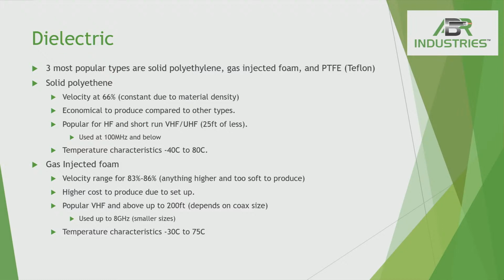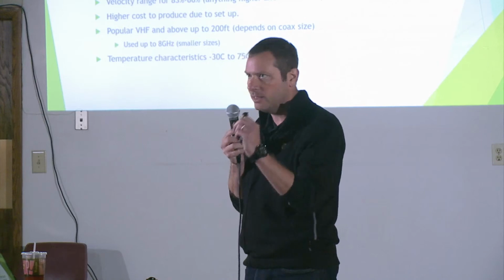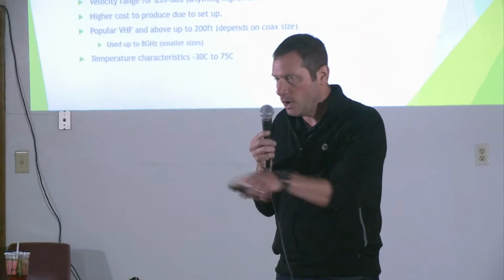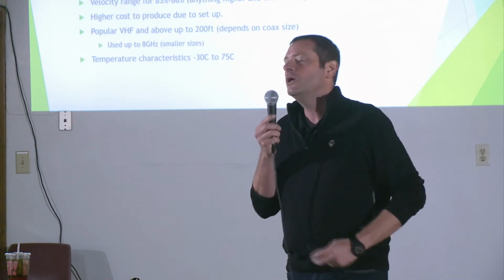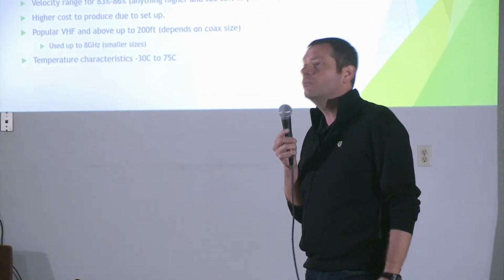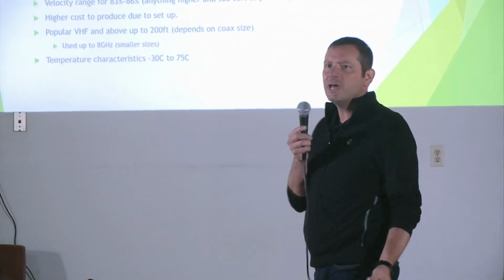most cables, you always have issues that if you get water into it, if you don't connectorize correctly, you can get water into it. Where the solid polyethylene had before, so you don't see it on 213, it's just a solid polyethylene, there's nothing coming in there. What 9913 had was an air core dielectric within the solid polyethylene, which allowed for water to get in there and obviously short your cable. So that is why that cable was great back in the day, but what they came to realize was that because of the air core dielectric, it was opening up for water getting in there. So just perspective on what a solid polyethylene does.